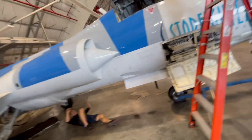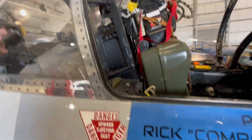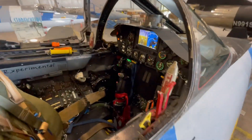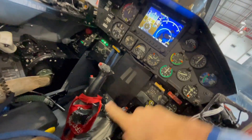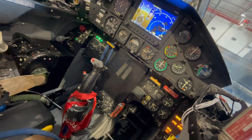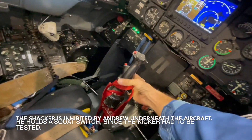What that does is it basically pushes the stick forward, and that reduces the angle of attack. It's a system that activates when the aircraft feels you're going beyond the angle of attack it wants — it doesn't want you to stall, so it helps by pushing the stick forward. Can you do it one more time? You're going to see this going to five or close to it, and you're going to see the stick moving forward — three, four — and then you can overpower it.